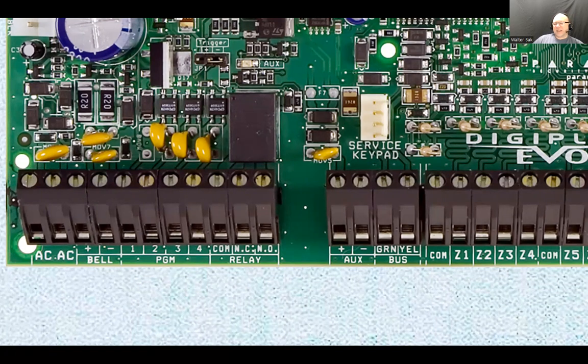It basically has a couple of terminals and it's looking for 12 volt DC voltage, and if it sees that 12 volt DC voltage, it's just going to go nuts in a way that it is designed for the human brain and human ears to be very uncomfortable with. And as far as those bells or sirens, they come in 15 watt and a 30 watt version. The 15 watt is pretty darn annoying and loud.